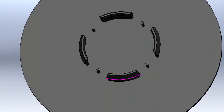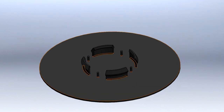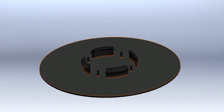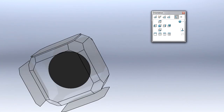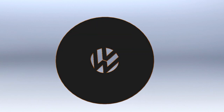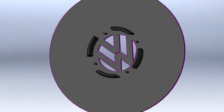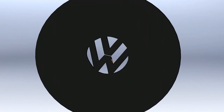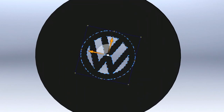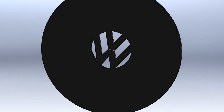We do another pattern so now we've got four pins, the retaining ring can sit snugly, and now we can move on to the front face which has our VW logo. I just got this logo off the internet, converted it to a vector, put it into SolidWorks, and did an extrude cut. There's the sketch right there — that's how we got the VW logo in the middle.